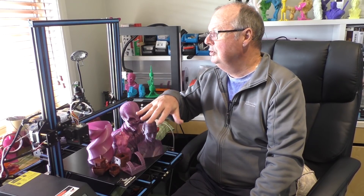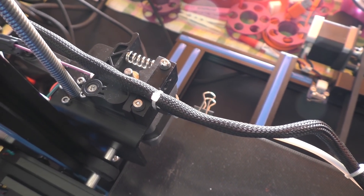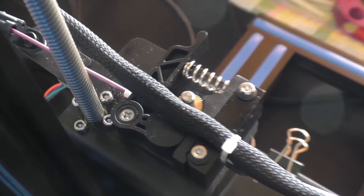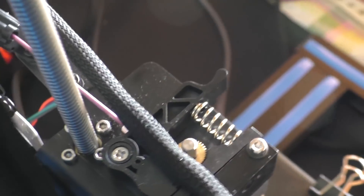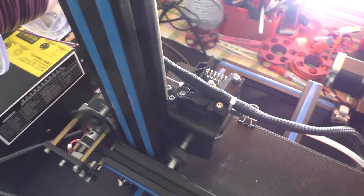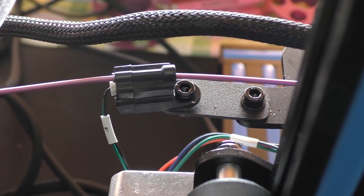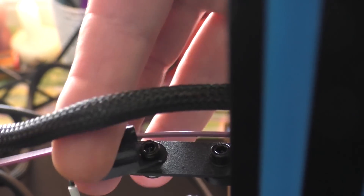We'll go through some of the features of the printer. It has a separate control box and a plastic extruder, but it does have a metal base plate that the Bowden tube screws into, so that's not too bad. They've included a little bit of PTFE where the filament enters the extruder, which is very good. The filament run-out sensor flops around all over the place so that you can put your feed spool pretty much anywhere and it will follow the spool — you won't get sharp angles for your filament feed. I really liked that — they're thinking.